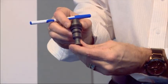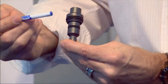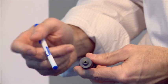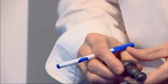If you're in with an ESS piston and taking a look at it, what you really want to do — and here I have a piston for you — is take a close look at the O-rings and also the very seat at the bottom. If there's debris and buildup along the seat, it'll prevent it from seating and therefore prevent it from sealing. Those are the two things you need to worry about. Once you put it all back together, you should be in good shape.